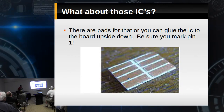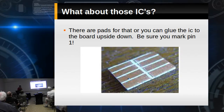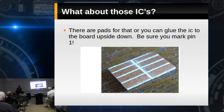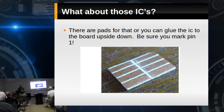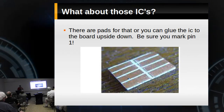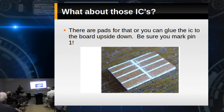Here's a pad made for an IC. The simplest way I've found is putting it in a vise — that holds it pretty still — then taking a hacksaw to cut and clean it up with a needle file. I've also cut them with a needle file and a pair of pliers. Now I do it differently: I go back to my ugly days, take that IC, flip it upside down, mark with a Sharpie which one is pin one, and make sure as I'm laying everything out that I'm calculating how it goes. If you build one LM386 audio amp this way, you'll be fine, but the first time you do it, it's almost like — wait, which one's pin one?